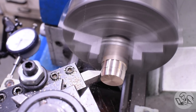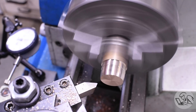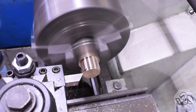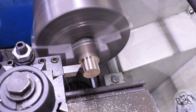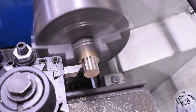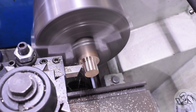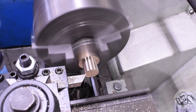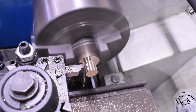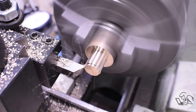What's happening there is the gib on my cross slide is actually loose and it pushed away from the work as it was turning. It wasn't noticeable until I did a heavier cut, so I paused, tightened up the gib, and proceeded to finish these cuts. I also changed out the tool to one I like better. The 85-degree inside corner tool is great when you need really precise shoulders, but honestly for these bushings I don't, and using a straight-sided tool like this is a lot quicker. The precision of the inside corner is down to how straight the grind on the tool is, but it'll be close enough for these boiler bushings.